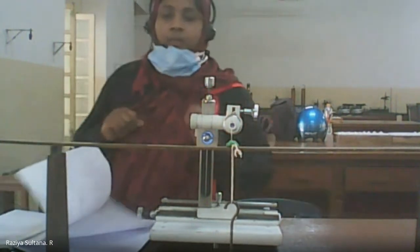To take the reading, here is the vernier scale. The zero of the vernier — indicated by an arrow — should touch the main scale, and wherever it reads is the main scale reading. You can use a reading lens to assist. The arrow pointing to the main scale gives your main scale reading in centimeters.